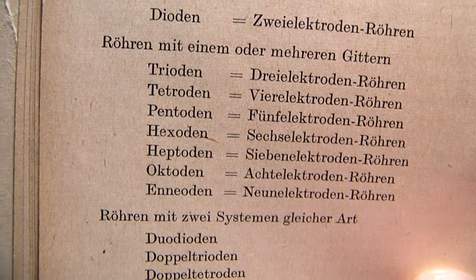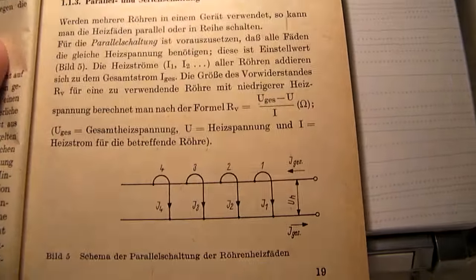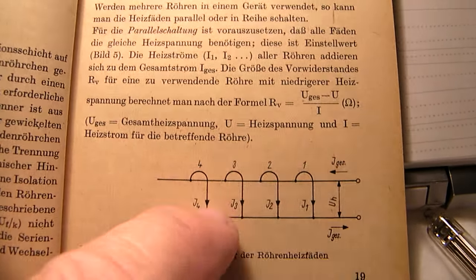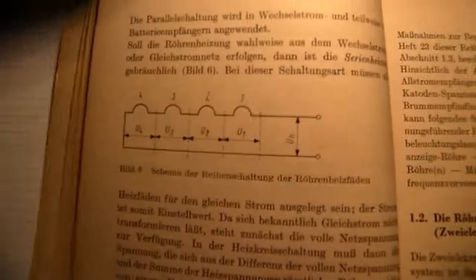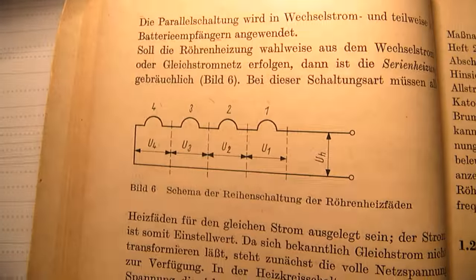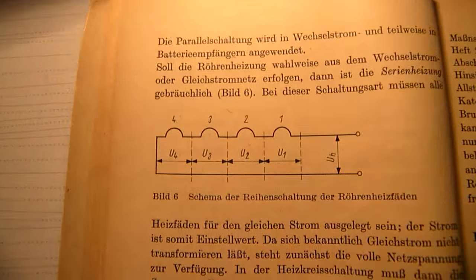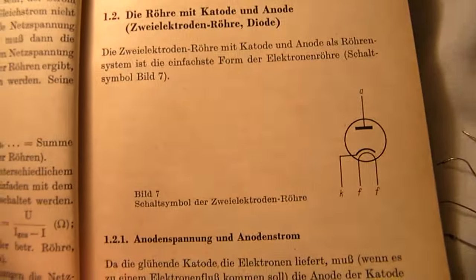You can see how the filaments could be connected. This is a connection in parallel — so every filament has, for instance, six volts or one volt, and the total voltage is also six volts or one volt. You could also connect the filaments in series. In that case, the voltage drop is related to the ohmic resistance of the filament, and that resistance changes when it's heated. So the voltage divides according to the resistance of the filaments. This is a diode tube.